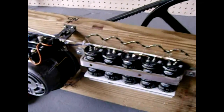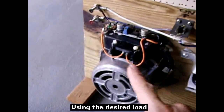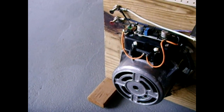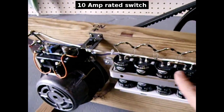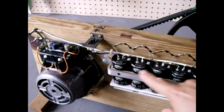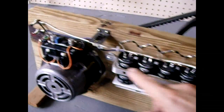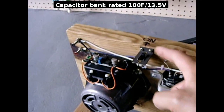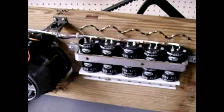If I want to charge the capacitor bank so I don't have to continuously crank, I push to the unregulated position for maximum power, then flip the switch to connect the entire capacitor bank to the generator. As I crank I'm charging the bank. Once the bank rises to 12.2 volts or a little higher, the green LED comes on to tell me to stop, and then I shut the switch to prevent discharge.